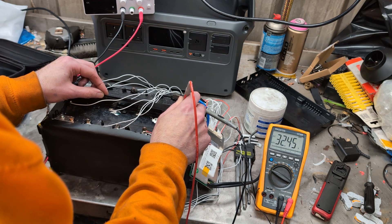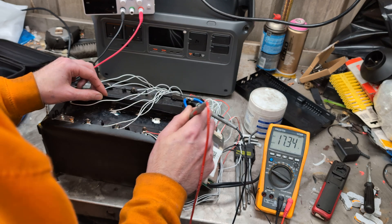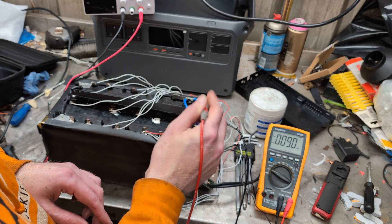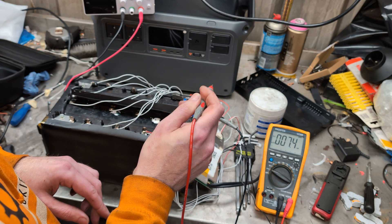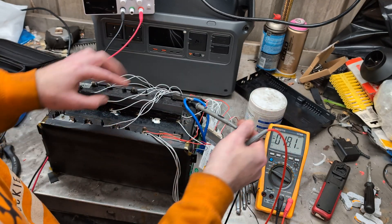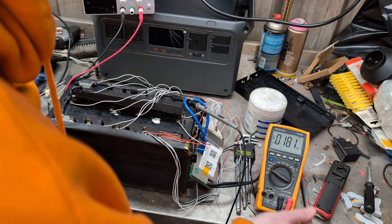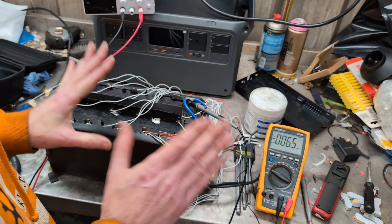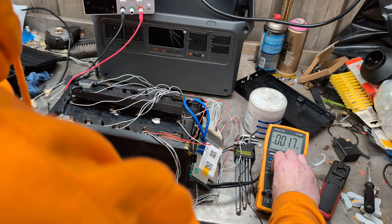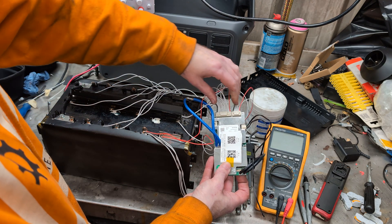46 not on the thing, 49, and then the final 52. This BMS wiring has a connection that goes to battery negative and battery positive at the ends of the BMS wires, and then the other 16 go in between to do your cells. This one does up to 22 cells and it has successfully recognised all 16. For the wiring, it's just a bit of common sense.